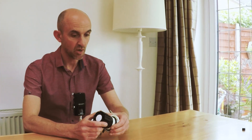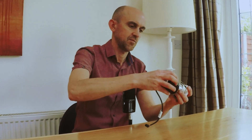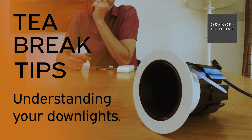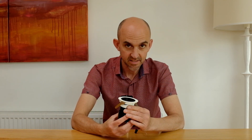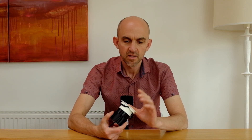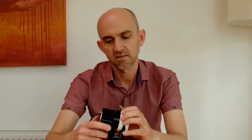Hi, I'm Andrew Orange of Orange Lighting and I want to show you what you need to know about an LED downlight. This is a dedicated LED downlight in that there is an LED source which is integral to the fitting itself. The LED chip is mounted on the back of the heatsink, and the reason they're stuck together is that the heat created from the LED source needs to be managed extremely well.